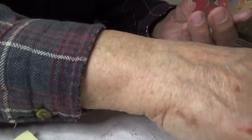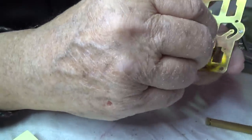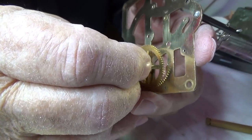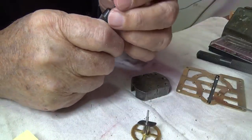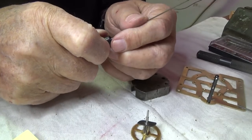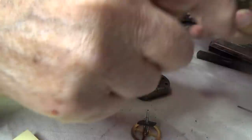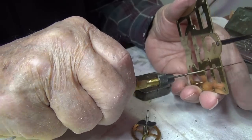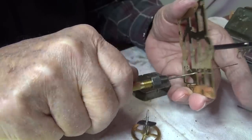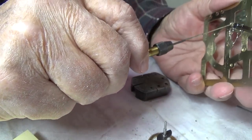And now we'll do the broaching. Okay, that's not going to go in there. Cutting broach. Oh, come on. There we go. Get in there. That's it. Okay. I'm going to take the cutting broach. I'm going to go into the back side. I'm going to cut ever so little. And that fits just fine. We'll just take a tiny bit off the front, through the front.